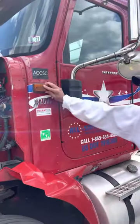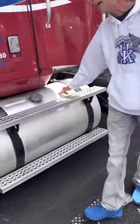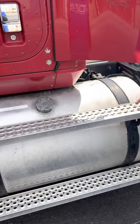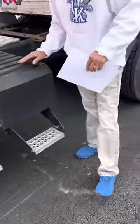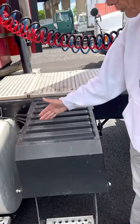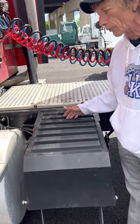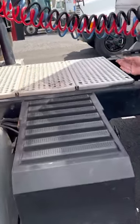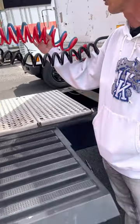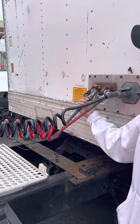I would check my turn signal like all other lights — amber in color. My fuel tank is secured, the cap is tight, and there are no leaks from the tank or the hoses. My battery box lid is secured, my batteries are not visible but I would make sure they're secured, all connections are tight, there's no excessive corrosion, and no leaks. My air lines — making sure they're not cut, pinched, or worn, and they're not leaking. All my connectors are seated and sealed with no leaks.